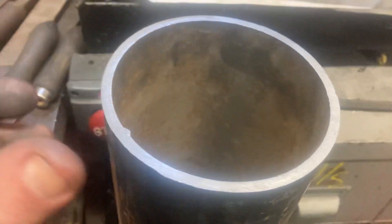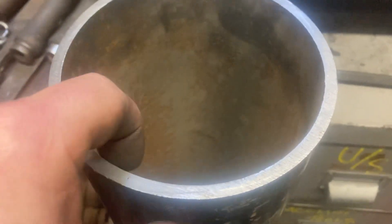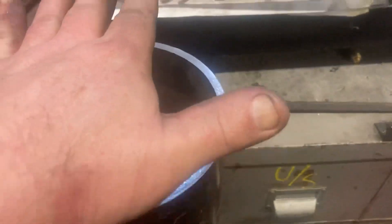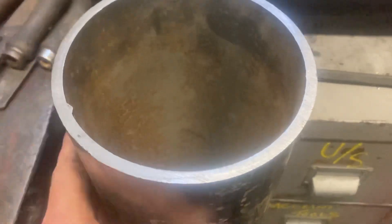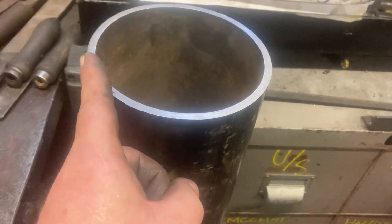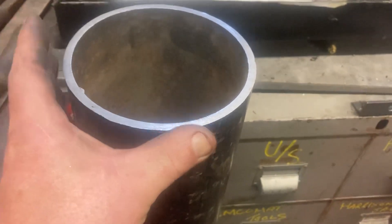The core is simply a mould that goes into the middle of the bush, so we'll cut a section of this. The other thing we're going to make is a steel plate that will fit on slightly smaller outside diameter than the pipe, but it will have a register machined on the inside that will fit into the bore of the pipe nice and snug. The idea is when the time comes to press the core out, you've got that press plate to go on top so you know you're pressing directly onto the core, not onto the white metal. I'm leaving it with Adrian Dennis to decide, but we might end up putting a slight taper onto it — only a couple of degrees, just enough so that when the core starts to move, it releases.